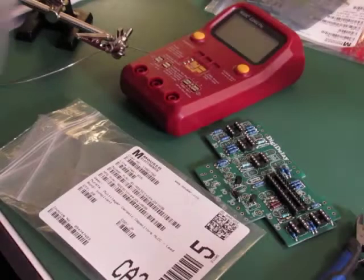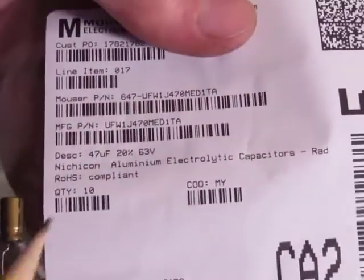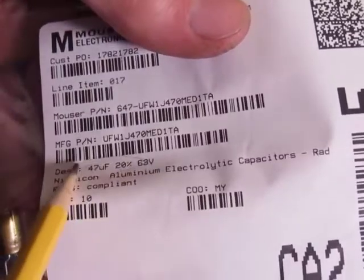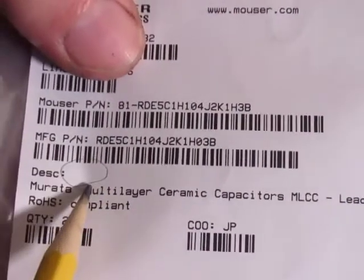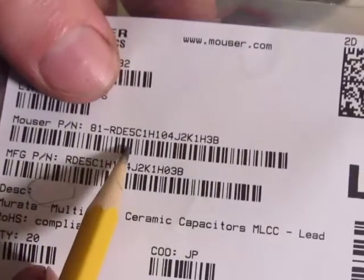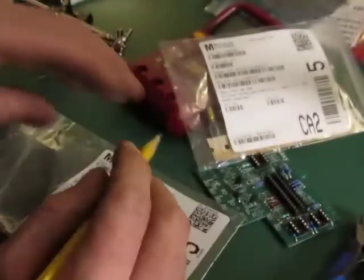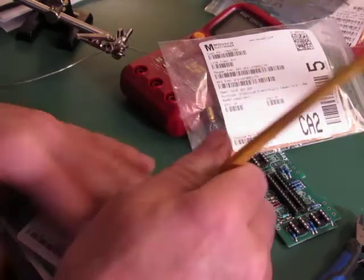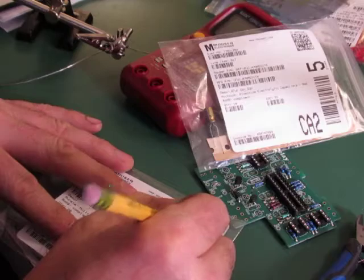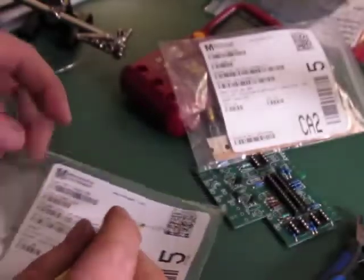I wanted to take a short time out to discuss reading values of capacitors. As you see on this package, this one's rated at 47 microfarads. It's indicated right there in the description field. But on this package, in the description field, nothing. But up there in the part number, you can see it, those three numbers there, 104, that is the indication. It's actually printed on the capacitor itself, too. What that means is it's 10 with four zeros behind it, which actually means 100,000 picofarads equaling 100 nanofarads.